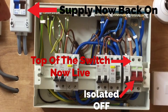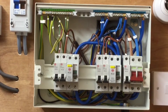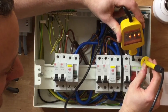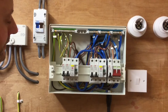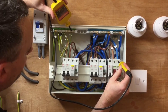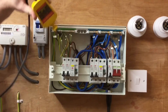I'm going to test first between line and neutral. I'll position my probes onto the least dangerous conductor first — the neutral — and then onto the line, removing the line probe first and then the neutral. Neutral on first, nice and firm, then onto the line — and we can see it's illuminated. Second test is between the neutral and the earth bar, going onto the least dangerous first which is the earth bar, then onto the neutral — and we can see the instrument is not illuminated.